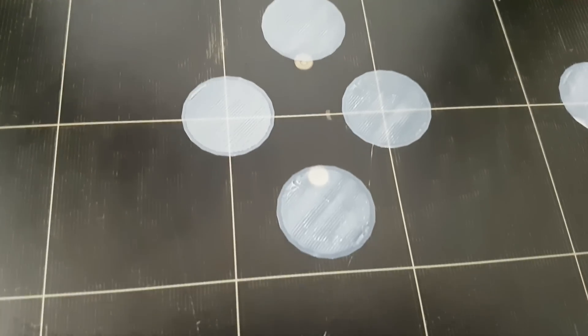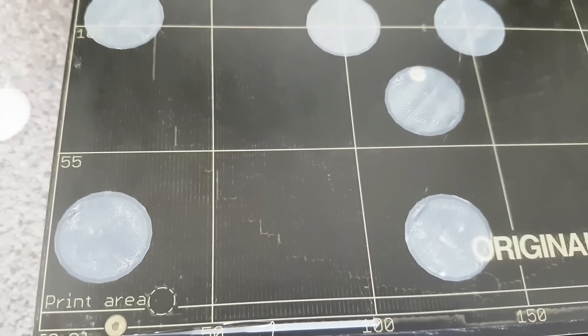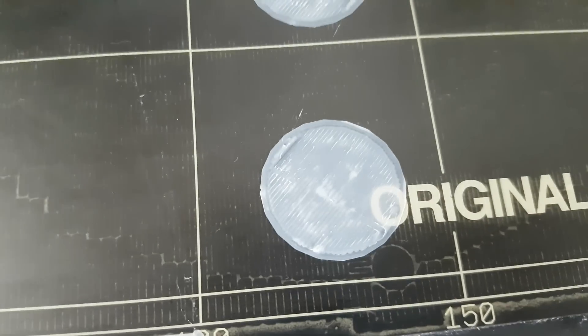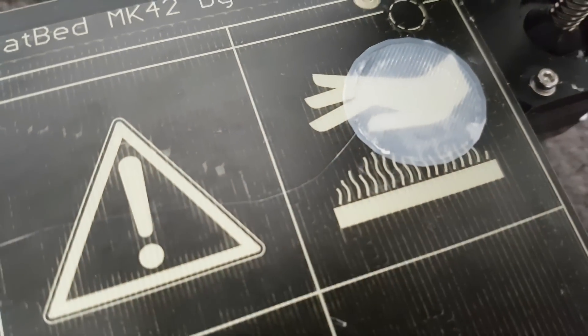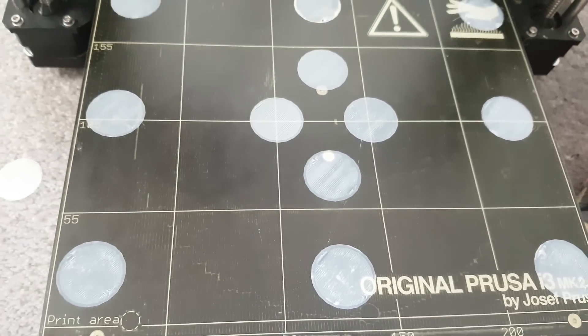I think what I'm going to do is one more try — I'll probably live adjust the Z by just about 20 microns and see how it prints. I'm hoping it isn't too far away for the ones over here, but hopefully it'll make these ones just that little bit better. Even at the back they're slightly too close, which is why I'll do that rather than just adjusting the front side once more. It takes about 49 minutes to print so I'll be back with the last part.